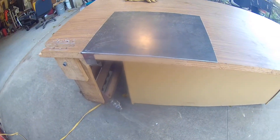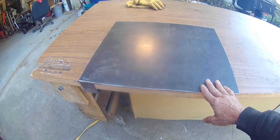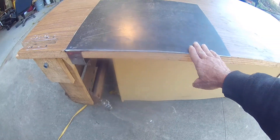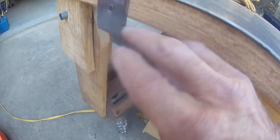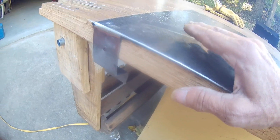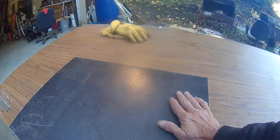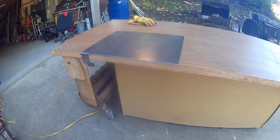The reason I added this plate was so I can do my welding. It dawned on me that if I have something small that needs to be welded, I'd have no place to do it. So I made this bracket, welded it to the top plate, and screwed it in so it doesn't move. I put my ground on here, which makes the whole plate grounded — so any piece of steel I need to weld is already grounded and I don't have to attach my ground wire separately.